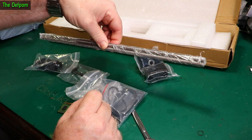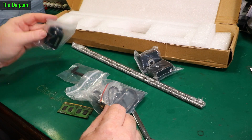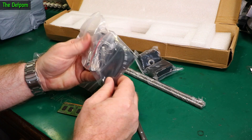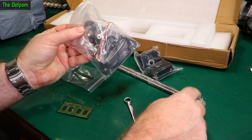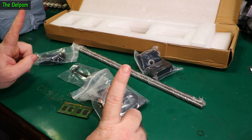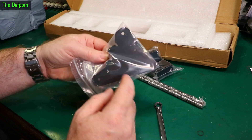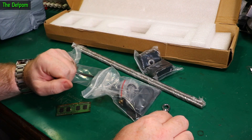You put a dual screw here like on the dual stepper motor version, and you link the two together. There's a belt and some little couplings that go on top of the screws, which ties them together so you can use one stepper motor to shift up and down both sides. In here is the bracket which would normally attach, which I've already got because I've installed it on the dual stepper motor version.